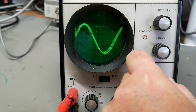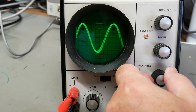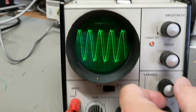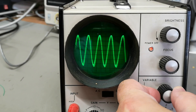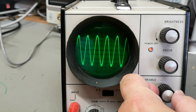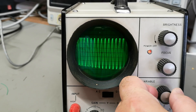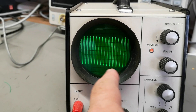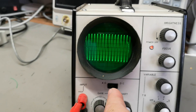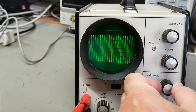So this is 50 hertz — the redrawing here, the resyncing and the trigger. I think this reveals we have a mains frequency hum problem or capacitor issue. I can find the magic point where it's really, really bad, and then here it's more or less okay. So there's a hum problem. We're going to look at some capacitors. It is in the deflection and in the trigger system, so it's probably the 200 or 300 volt supply. It's going to be easy to fix this problem.